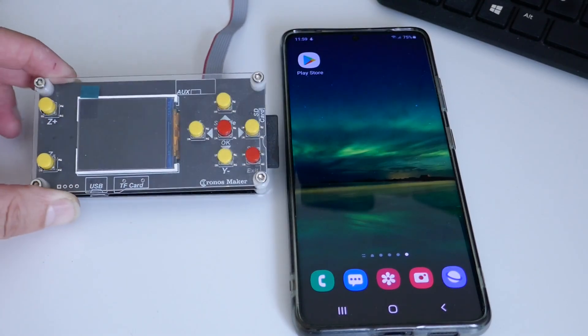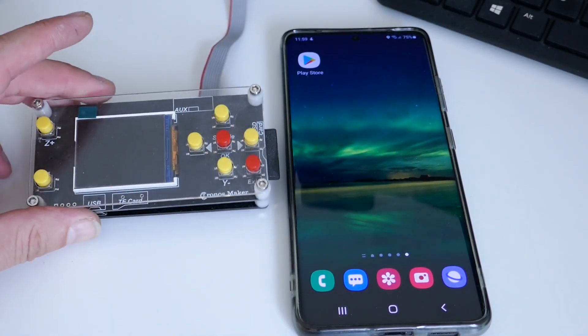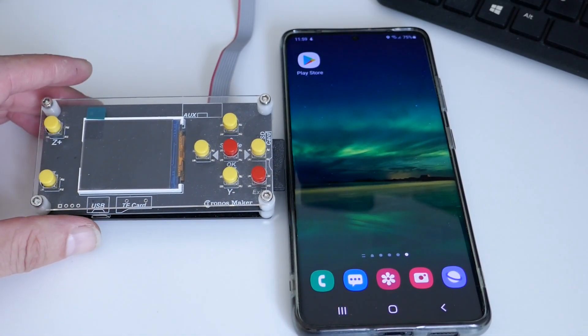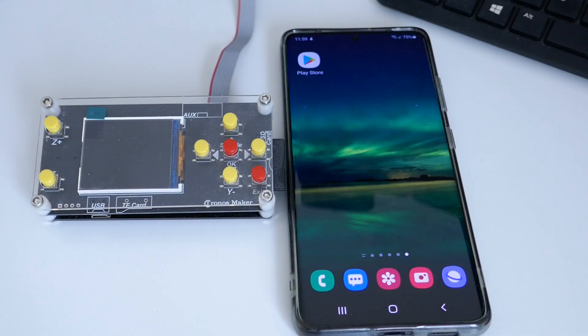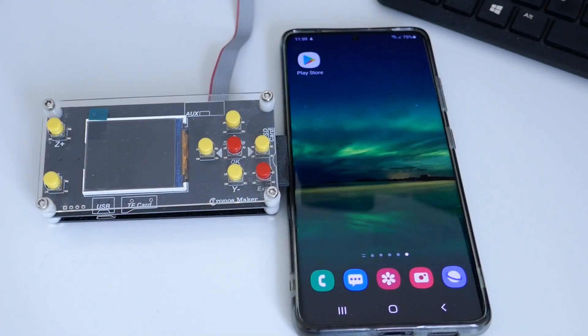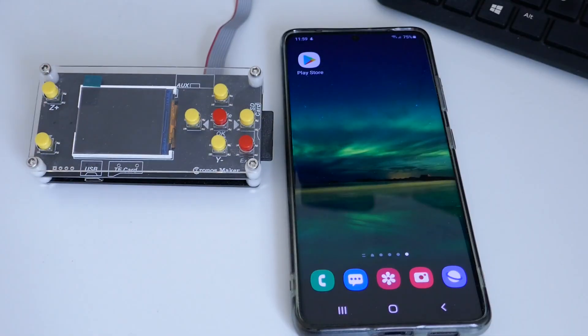It has quite a few drawbacks though. You can't use a probe unless you write a special file to put on the SD card that will run a probe. Zeroing the axis is also very difficult — it usually zeroes where you start your print from, and unless you program a Z-lift as the first move, you could end up scoring your bit across the top of your material.